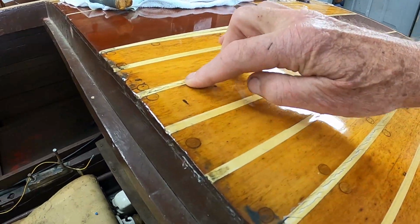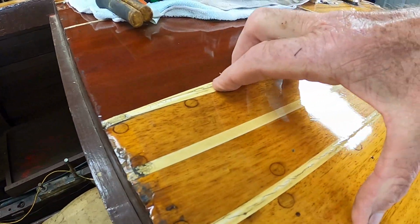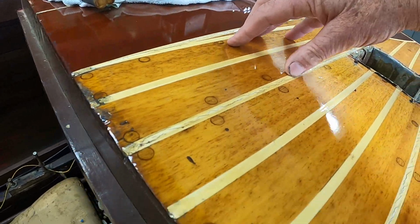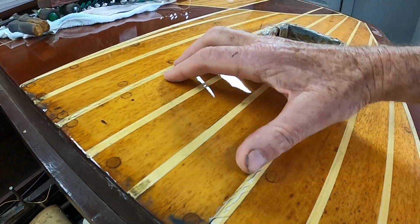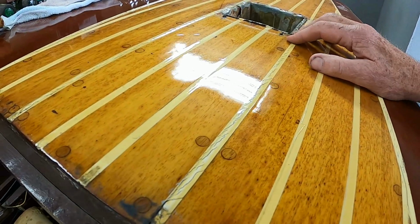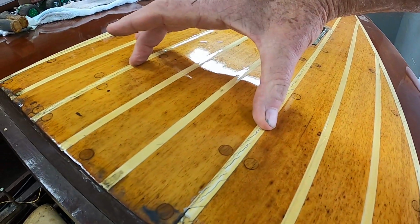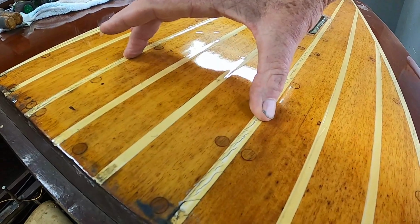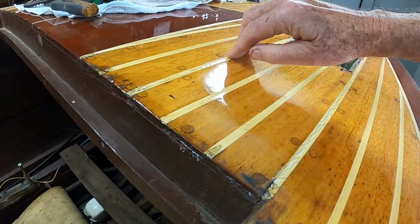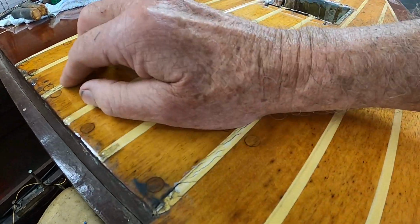But look at this one, and look at this one, and look at this one. So these guys, this plank has moved around. I mean, a boat's going to move on the water. This one's moved around, and over time, you get this crazing, these cracks. Well, these two seams are functional. They're waterproofing, because if they're not there, water gets on the deck. This is just a simple lap joint. Water is going to work underneath, and guess what? The rot begins.